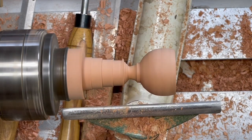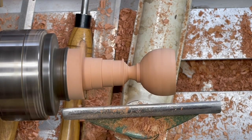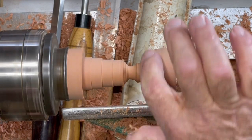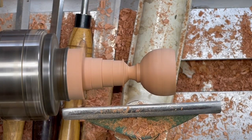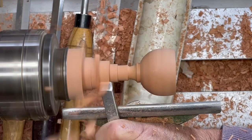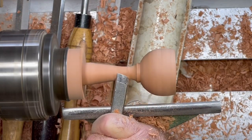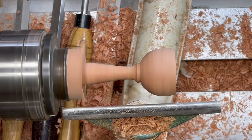I'm going out the long point here. I'm going to use the parting tool on an angle like a shearing cut to come into that. Give it a little inch. Okay, that looks okay. So now I'm going to clear away a little more. Maybe I should use my half inch skew for a project this size. If you're getting a lot of vibration like that, you could cushion the cone or some other custom adapter for your live center, but I think we'll be okay.